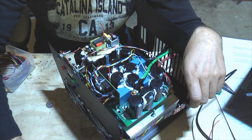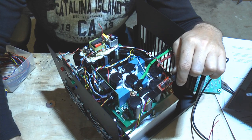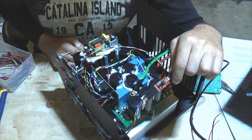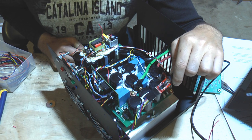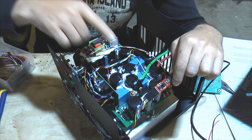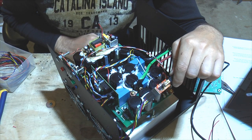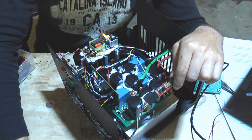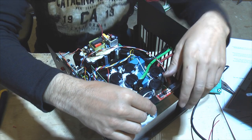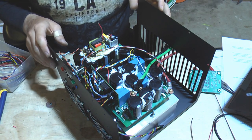Hit upload and watch the FTDI board — it starts flashing, meaning serial communication is active and data is moving from the computer to the board. After a couple of seconds it stops and the computer confirms upload is done. Your Arduino is ready to go. Unplug the FTDI cable and set the programming cable aside.